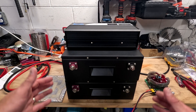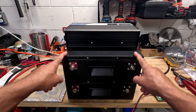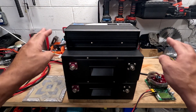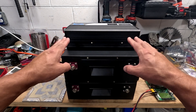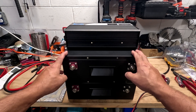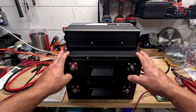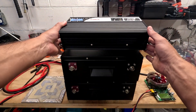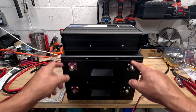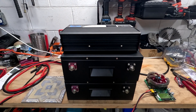It is the next morning and we are all charged. I ended up charging one of these with my solar battery bank. To run a discharge test, I'm going to charge back the solar battery bank so not a lot of energy is lost. We've got a 2,000-watt 48-volt inverter — I'm going to hook that up to this, then power up a charger over there to charge up the big battery bank.